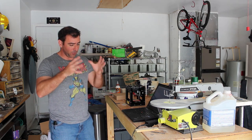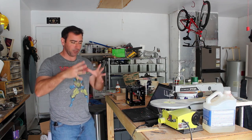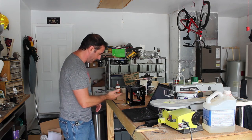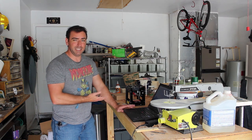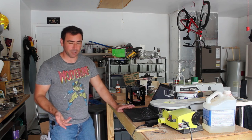You dump a bitmap to the serial port — just cat it out — and it has to be monochrome, one-bit, so not grayscale, just black or white. No shading unless you do every other pixel. I already made a bunch of example images when I ordered this. You gotta flip the image so text isn't backwards. It's very simple — you could theoretically hook this up to a Windows 95 machine, send serial commands, and print. You don't need any special software or drivers.